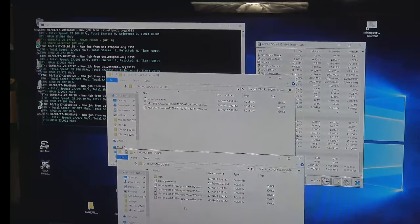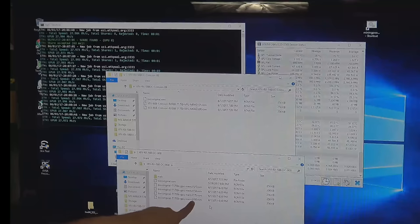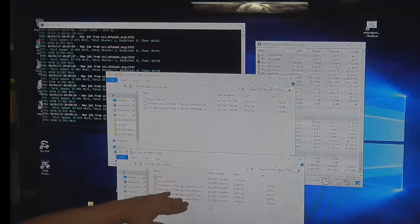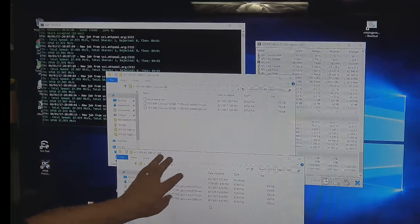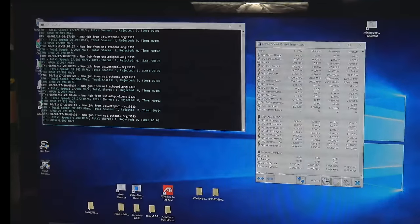And we'll get these two sets of BIOSes uploaded. Just for any of the people just joining, the BIOSes are going to be uploaded in the description today. I'm going to name them 2200 through 2125 with all the in-betweens. These are separately hard-coded memory settings and GPU settings that work with this setup that we did the testing on. So if you put the 2200 and it doesn't work, go down a level, down to 2175. You'll drop just a little bit, like 0.5 mega hash in each one of these drops, but you'll get it to where you're stable. So we're going to start doing that with all of our cards.